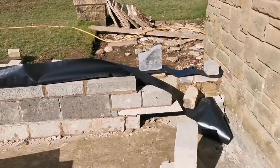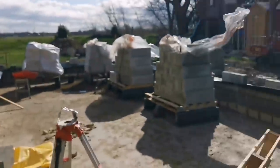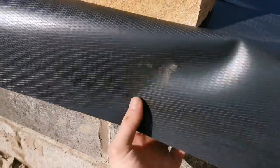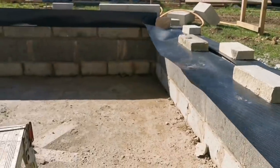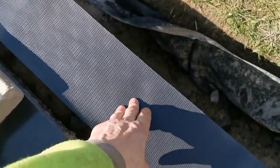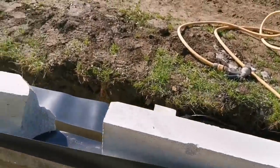So that's it, we're just waiting for an air brick in that side, one in that side there, which is going to get picked up tomorrow. We've got our damp proof. So this is going to be a tray that goes down like that, and then visqueen will go up behind it, and then the concrete will be at this level on here, so that'll go like that. And then I've just put 6-inch damp up front, just because some of these stones are more than 4 inch. Which should be alright, but we'll see. He's coming, should be in about half an hour.